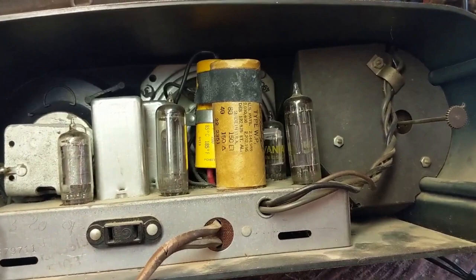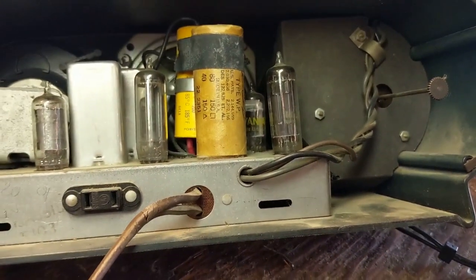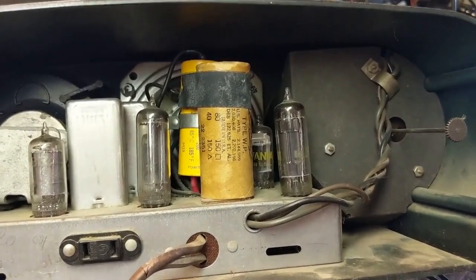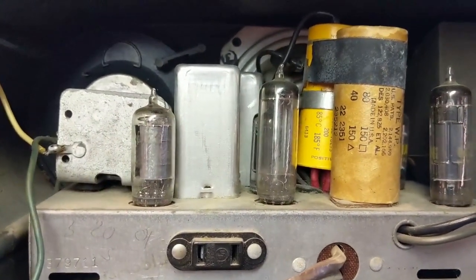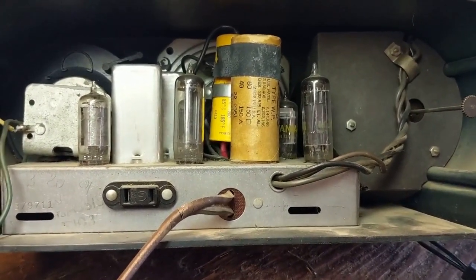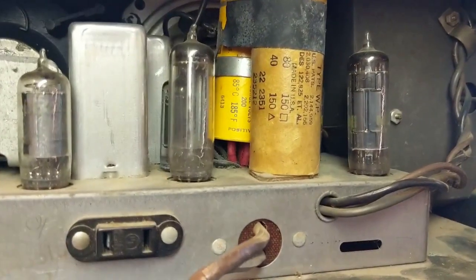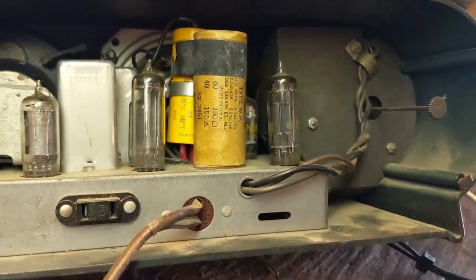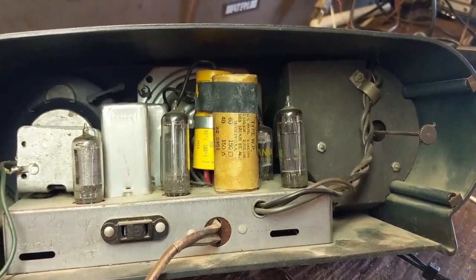These guys are kind of a pain as well because it's got this long umbilical cord that goes to the clock, so you take it out and you kind of have to dangle it from that cord. I think the speaker is also physically attached to the front and there should be some little spade connectors to disconnect the speaker. Let's take this apart and see what I expect — probably all original parts except for the electrolytic, which will need to be replaced. According to the original schematic, it's got two values: an 80 microfarad and a 40 microfarad, rated at 150 volts max. We'll replace those in kind.